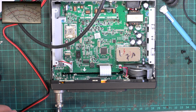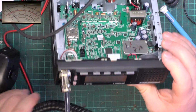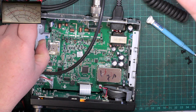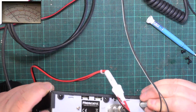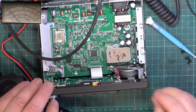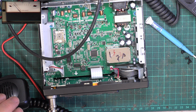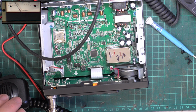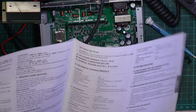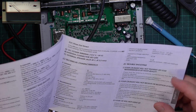So I'll just put the signal generator on. So we need to be plugged into the test equipment as far as the audio goes, so that it reads on the Synad meter. The radio doesn't have PA, for those of you who need PA. And we'll put this onto the Synad meter so we can all see. There's 12 dB. 0.3 of a microvolt for 12. So I think it's, let's see where 20 really is. 20's there, and it's 0.65 of a microvolt.